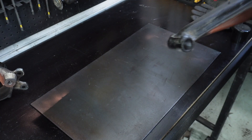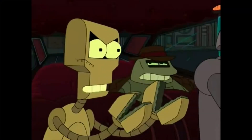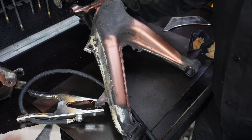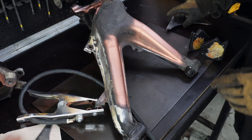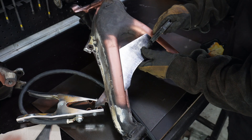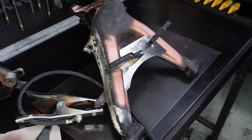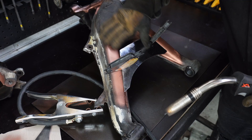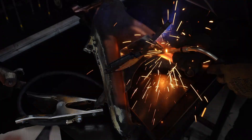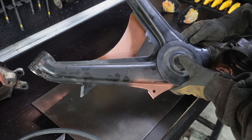I just put my hand in the weld-through primer. Don't put your clamp in the bore of it - you don't want to arc out in there and create mess. I've put weld-through primer on the rear of it. We're going to work out where it wants to sit naturally - that's sitting pretty nicely. Because of the way we've made the plate, we don't need to hit it down to follow the contour of the trailing arm. I think that's all sitting in there pretty nice and neat. Let's tack it in. I'm pretty happy with how that looks - that looks pretty schmick.